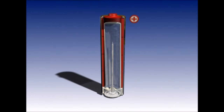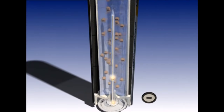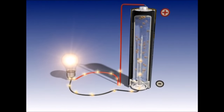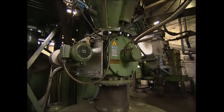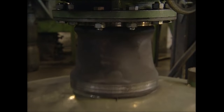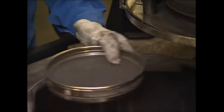We've established batteries have a positive and negative pole. The negative pole is full of electrons which are all trying to escape. Electricity is the force used when they move from a negative pole to the positive one through an electrical circuit. The materials used to make the positive pole are manganese dioxide and graphite. You might be familiar with graphite as it's used to make the pencil. The positively charged mixture works by absorbing electrons that pass into it, and gets pressed into rings which are then inserted into each battery case. The more that can be put into each battery, the longer that battery will last.